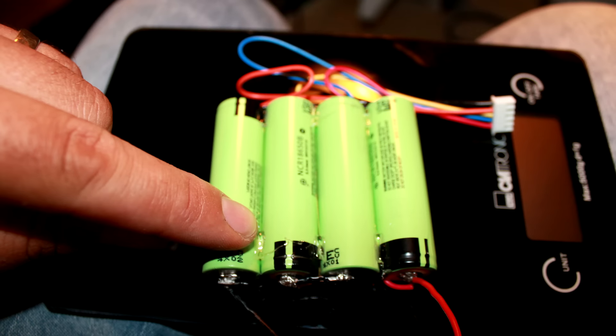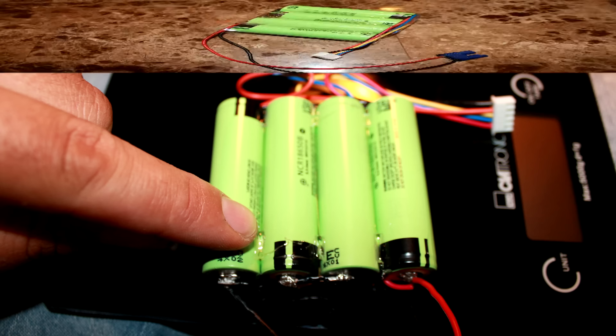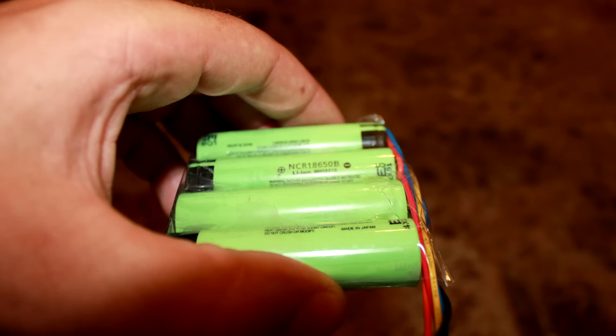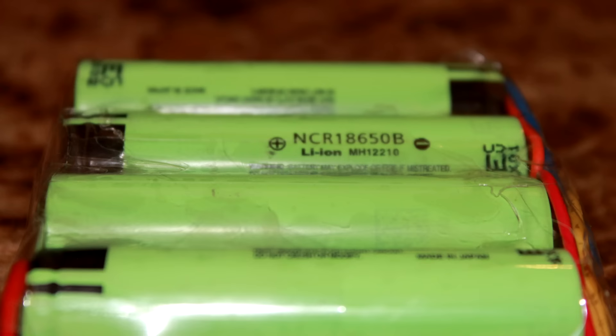You're going to bunch all your wires up, try to flatten them as much as humanly possible, and then wrap them in a pack. Either you can use some type of shrink wrap, or what I've used which is just some clear packing tape. I made sure that I had two or three wraps on each side to make sure there's no way to bang up the NCR 18650Bs, as the outsides are actually all negatively charged. There's the side view of the pack. Please be responsible when building this pack. Thanks for watching and please subscribe.